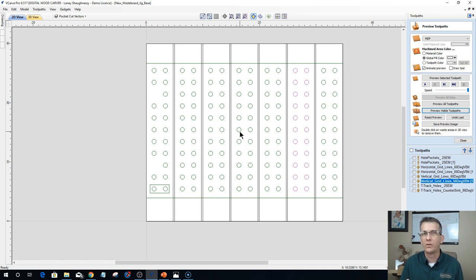I can drill the holes and the grid lines and it was the same piece from when I originally started. If I ever drill or cut and it gets beat up, if I bury my bit for some reason into it and ruin the wasteboard, that slat or 2 slats, whatever, I don't have to replace the whole wasteboard. I only replace the 1 or 2 slats.